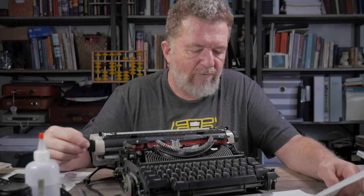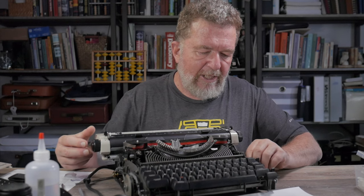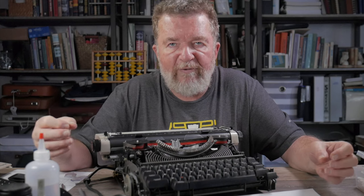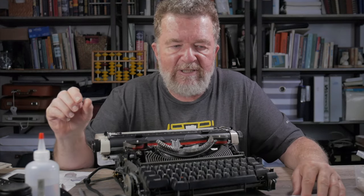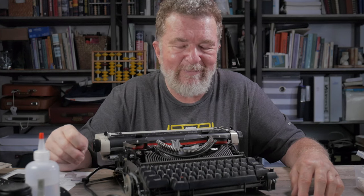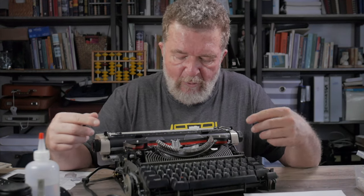Too much drag from the auto carriage return mechanism — I don't think that's the case. It's only turning a little pulley and a gear, and those aren't really affecting carriage tension. The tabulator brake dragging on the carriage: it does engage on the escapement gear all the time, but taking it off made no real difference. After cleaning and degreasing — especially the escapement, including those two little arms with the spring — and changing the spring tension, it's working a lot better. I'm only noticing piling occasionally near the right side.